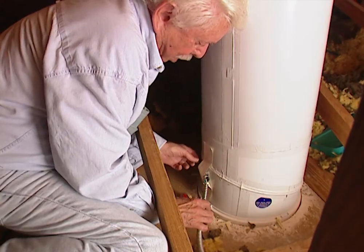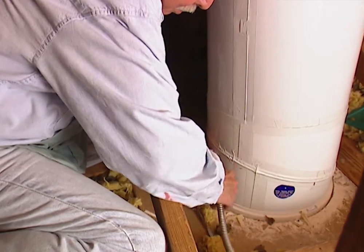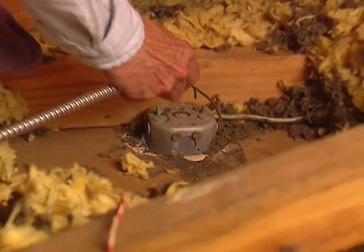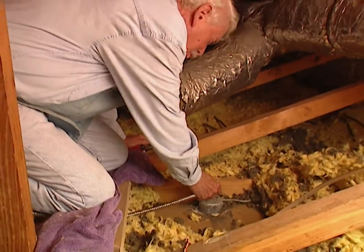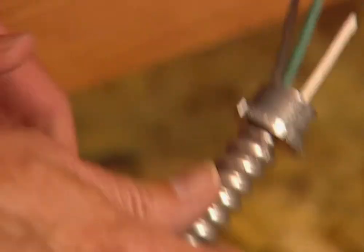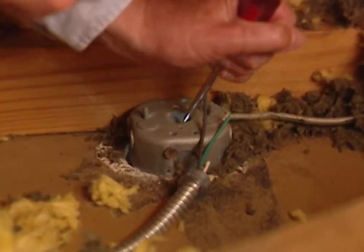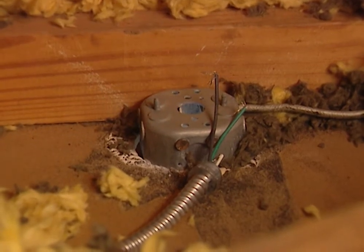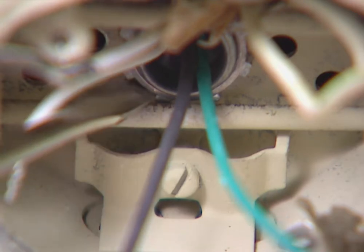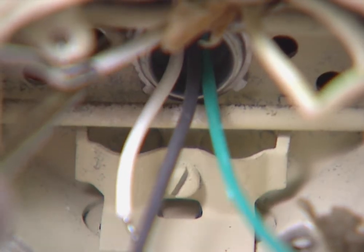We need to slide the flexible conduit into the coupler, but first I'm going to take off our tape — it did a really good job and it's a good trick to remember. When we slide this in, we have screws on this bracket that will hold it in place. We're going to run these wires through the conduit connector and it screws right into the flexible conduit. Then we take a screwdriver and a hammer and knock out this plug. The connector is sticking down through the hole; a few more turns on this little nut and it's going to be good and snug.